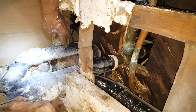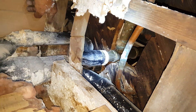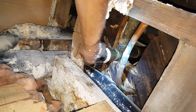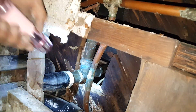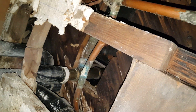So what we're going to do, we're going to cut it here. We're going to get rid of all this black stuff here, and then the whole brass piece that's on the tub. Because right back here, if you're not looking, you can't see where the heel fitting comes from the tub itself and hooks to the waste and overflow tee right there. There's a brass nut that hooks to the brass threads, and that's split.